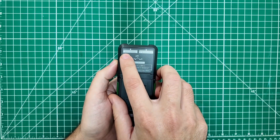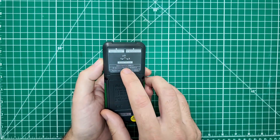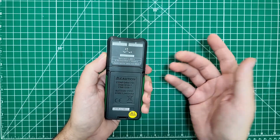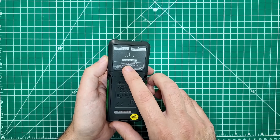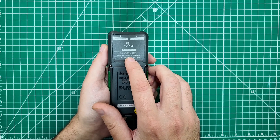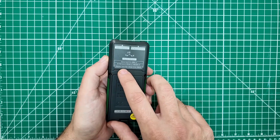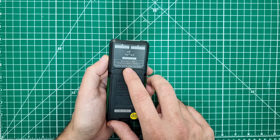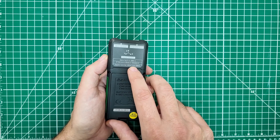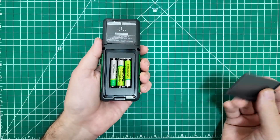On the backside of the meter, you can see it has its electric field sensor at the front. Its microwave or RF antenna is also at the front, and then its magnetic field sensor. It has a little diagram here — ZYX. Electric field is 1 volt to 2000 volts. The RF microwave range is 0.001 milliwatts per meter squared to 200 milliwatts per meter squared. Magnetic field is 0.01 micro T to 200 micro T, or 0.1 MG to 2000 MG. I'm used to Henry, so I'm not really sure what measurement that is. And then you have your battery case.